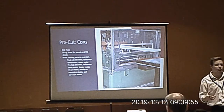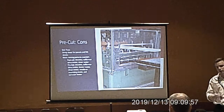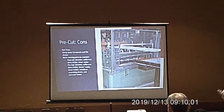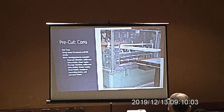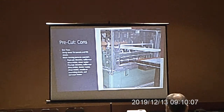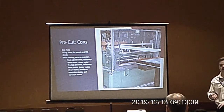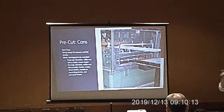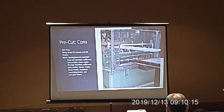Another consideration: if you want all your metal building equipment for trims and panels while minimizing initial investment, pre-cut is cost-effective but not time-efficient. For example, with an ag panel, many guys run 29-gauge 80 KSI for panels but 50 KSI 29-gauge for trim. If someone has an all ruby red building — ruby red panels and ruby red trim — you don't just run panels and then stop to run flat sheets off the same coil. You want to swap coils for the other tensile strength, meaning a lot of coil changes.